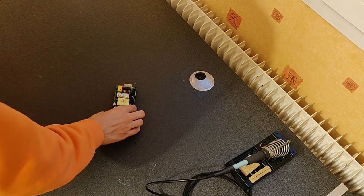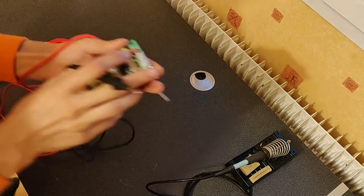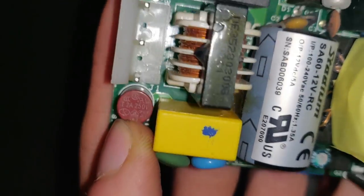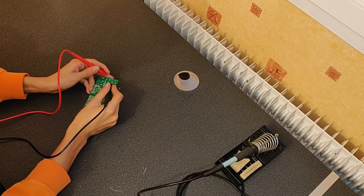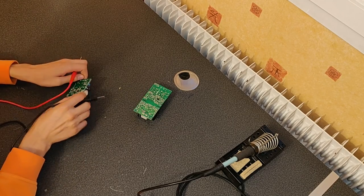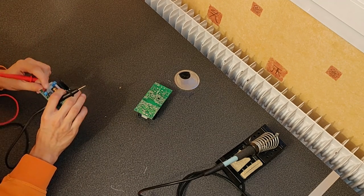Let's start with the most obvious thing — the fuse. There is an actual fuse in it, in this little box here. It's a 2-amp fuse. 'T' stands for time-delay, meaning it's slow to react. Let's check it. Here we have our first issue: the fuse is blown.